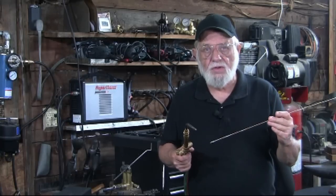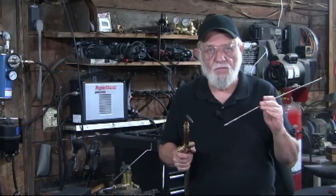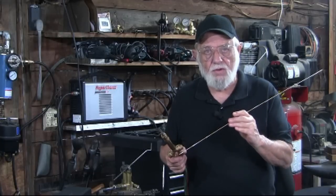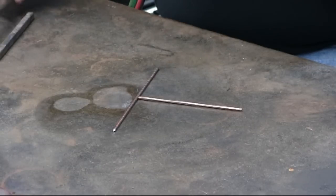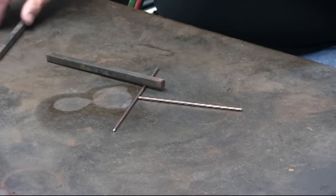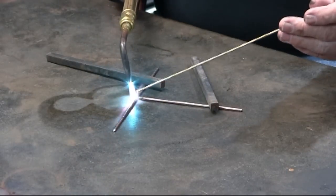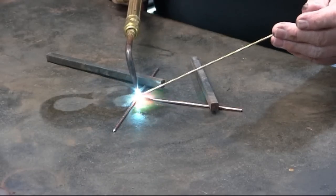Now I have a shortcut to this, what I call a Daba Bronze. I use this frequently, as you'll see in many of the different pieces that I do. Here are two rods I want to braze together. I'm going to use these 3/8 inch square steel pieces to hold these in place so that they don't roll around, then braze them together. Very simple.